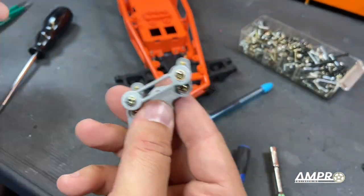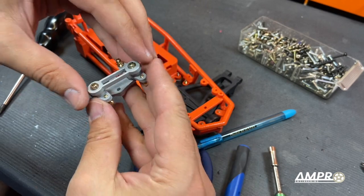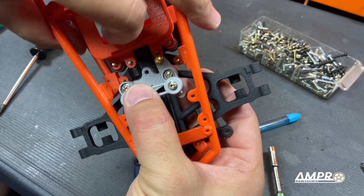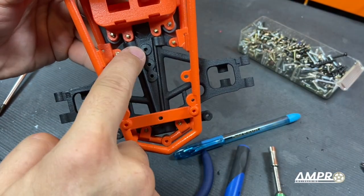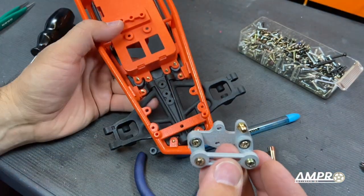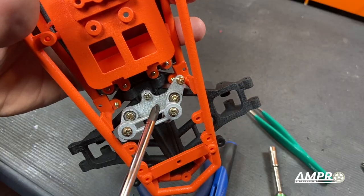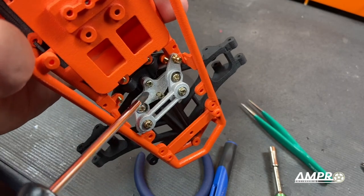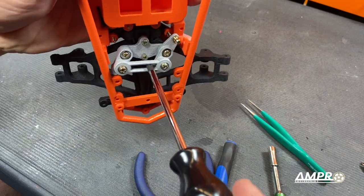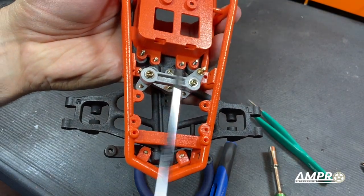We can now install this very simply. It goes in this orientation, and it drops right there on the rear. See that screw hole and that screw hole. It goes on the rear ones just like that, and you use a 12mm long M3 self-tapping screw to hold those in place. This will be held in place by a 12mm long screw and an 8mm long screw. And it has occurred to me that it's a little bit hard to get your screwdriver in there, so perhaps I should have installed this later. So just a heads up, put this on afterwards.